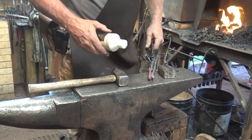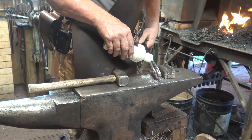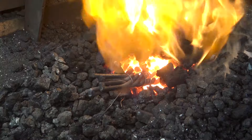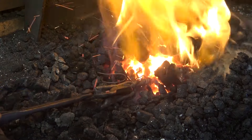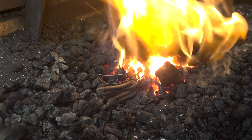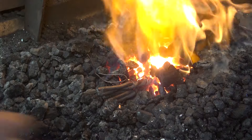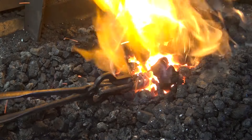That's about the best we're going to do — they're kind of loose, not as tight together as I would like. But all I do is kind of move them around in circles, and once we start welding them they'll stay together better. I'm going to turn them around over and under, back and forth, and just try to get them to heat evenly. I'm shoveling coke onto the fire. I would not put green coal anywhere near the fire during a welding heat — that's just going to suck the heat right out of there. They're up to a bright orange; we want a lemon yellow color.